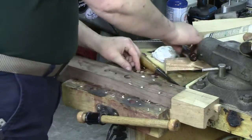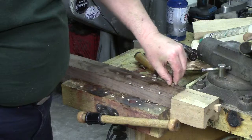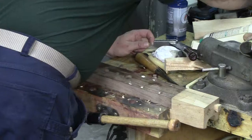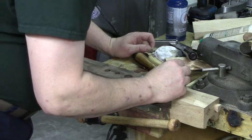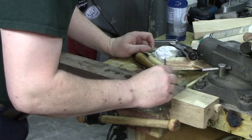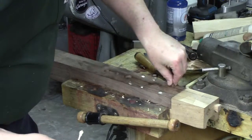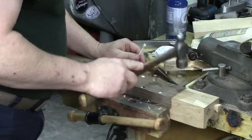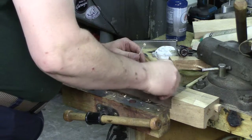So how I like to do my dowels, again, we're going to be doing sanding and stuff on here, is I'll put them in and I'll twist them a little bit, get a little bit of that glue spread. Or actually, this is where I keep Q-tips in the shop for stuff just like this. Spread it around a little bit in the hole. There we go. If we have to add more, we can. Spread it around in the hole. Get it started. Tap it in. It's that simple. Nothing super secret, scientific.